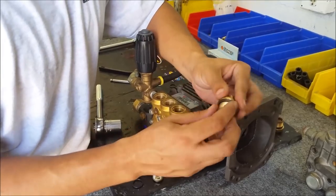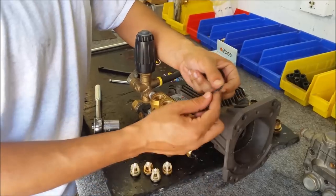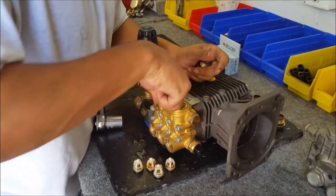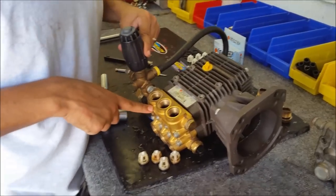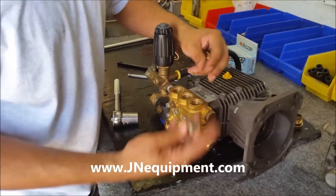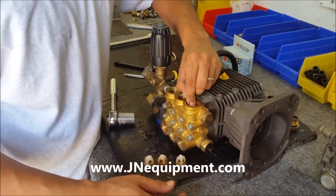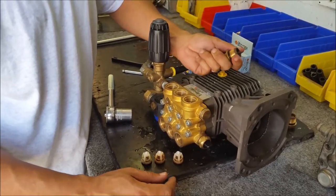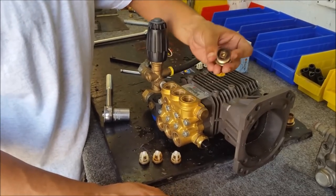I got it nice and cleaned up. I'm going to reset my spring up there, take my O-ring and put it in first, use my finger to make sure it gets down in there in that seat. Then go ahead and lower the valve in, pushing it down a little bit until it finds its home, and then this cap is going to line up right there and I would screw this down.